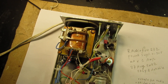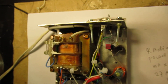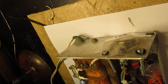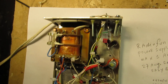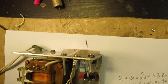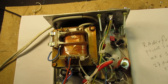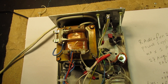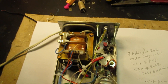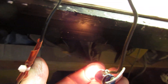Here is the power supply transformer, and here is the transistor that does the whole job — the 2N3055. It's important to note that the 2N3055 must have an amplification factor, or beta, between 50 and 70. Sometimes when you order 2N3055s from various sources, even reliable ones, their amplification factor when measured with a transistor tester does not meet 50 to 70 times — sometimes it's as low as 8 or 10.